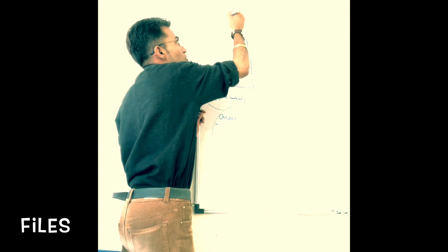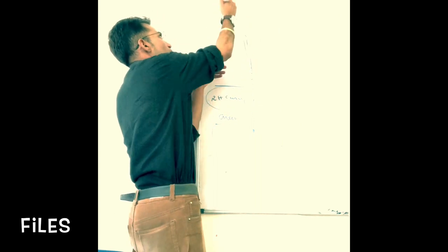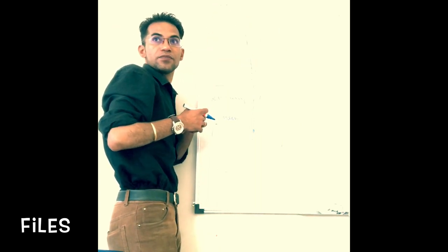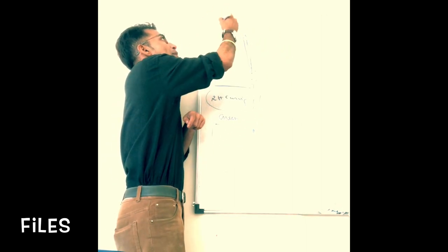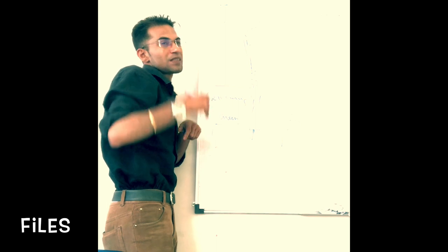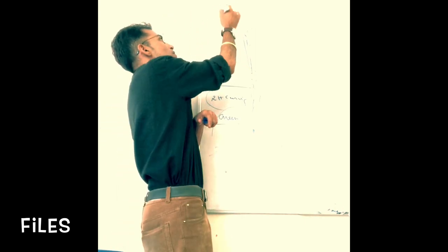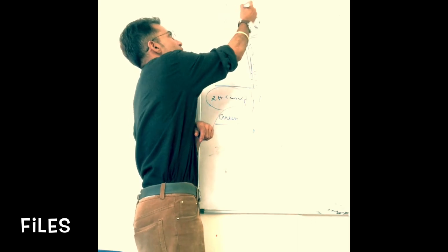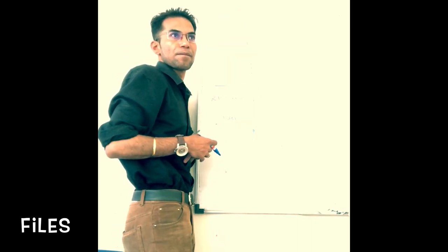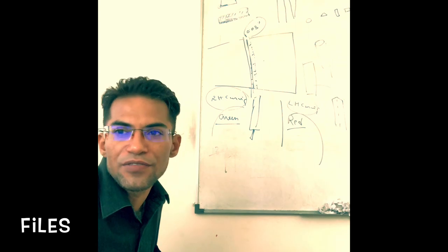And further, we are using this file. The file will have this cutting, and it will remove the metal from this place. But because the edge also has teeth, whenever we are filing, unintentionally we end up removing metal from this side as well. So what we need is a blade where there are no teeth along the edges. But sometimes we do need some flexibility. So the best option would be one side with teeth and the other side plain. This type of file we call a hand safe edge file.